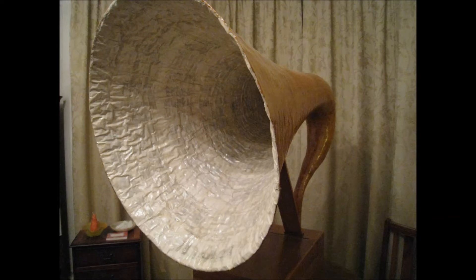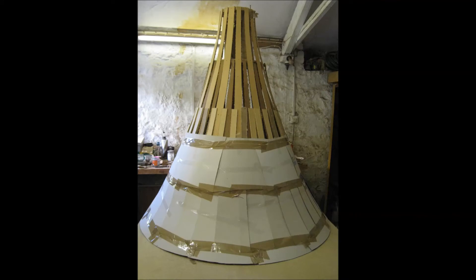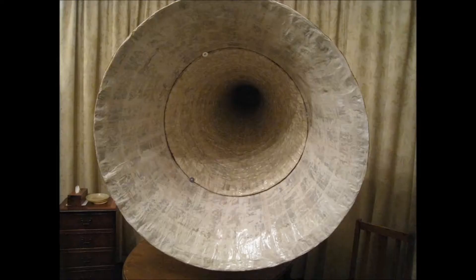Gramophone number five was simply Gramophone number two with a widely flared extension to the horn. The mould for horn number two was mounted some 14 inches above a baseboard and extended downwards to create a horn mould called four feet — 1.2 meters — in diameter at the open end, which was used to make a horn extension of some 34 layers of pasted paper.